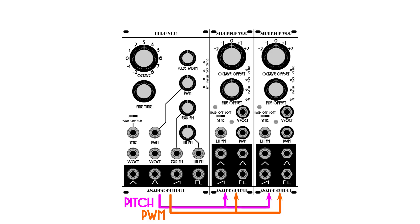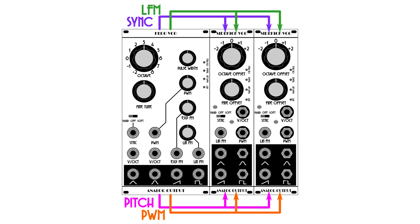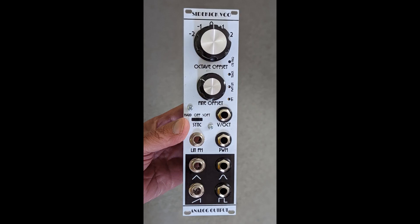How many sidekicks can you connect? The signals are buffered on both sides, and in principle you should be able to add several — I'd think three, four, or five, maybe even more. I've only ever made two Sidekicks and it works with two. So for a three-oscillator voice, you'd just need one Hero VCO and two Sidekick VCOs — 20 centimeters wide instead of 35, and three patch cables instead of 11. The Hero VCO also sends its linear FM signal and its ramp wave output to the Sidekick modules so they can sync to it.